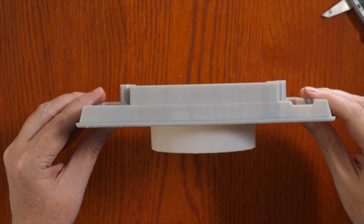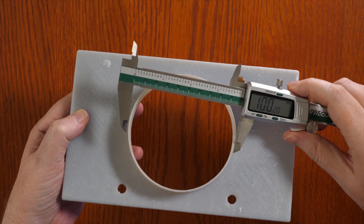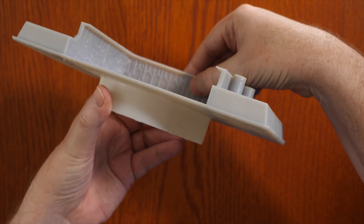Okay, so there are a couple of problems. First, the overall scale of the piece is off — this tube doesn't fit in the hole in the wall. Even when it's printed correctly it'll still be a pretty tight fit. I measured it and the tube is about two percent too large. I also printed this parallel to the build plate — this was my first large piece, and the way I printed it caused two problems. Some of the supports inside the slot were too close to the sidewall and they merged with it, so it would take serious Dremel work to clean that up.